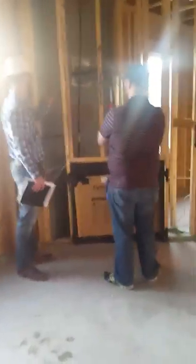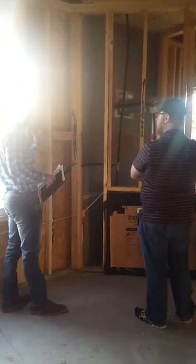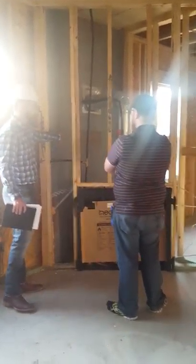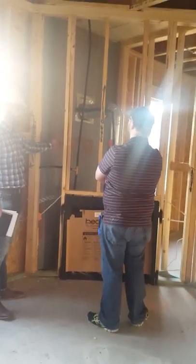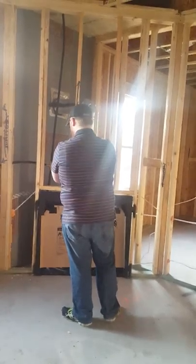We know that there's no drywall really here, so that insulation performs at its best capacity when it is encapsulated on all 6 sides: outside, front, side, top, bottom. So we put this T-ply in here to make sure that we're encapsulating that, so that you don't get excess drafting or anything coming through, fighting the acclimated air you're trying to put within your home.